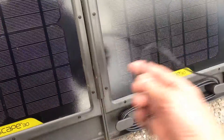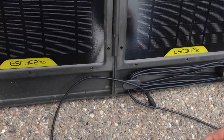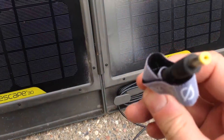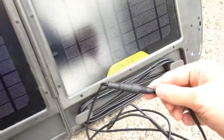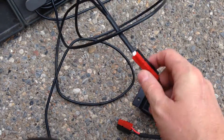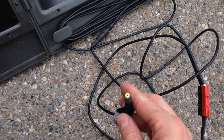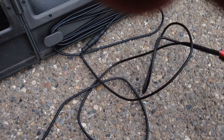The panel comes with a DC barrel connector, but I use Anderson power poles, so I built myself an adapter. I found that Goal Zero had an extension cable with the barrel connector on one end and a female end on the other. I split that cable and terminated one end with Anderson power poles, but I kept the original connector on the other end so I can still use the panel the way Goal Zero designed it if needed.